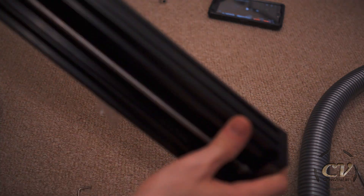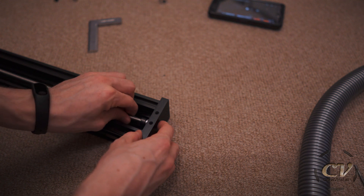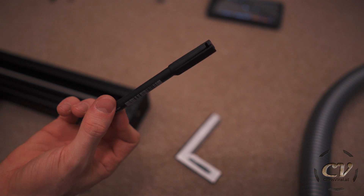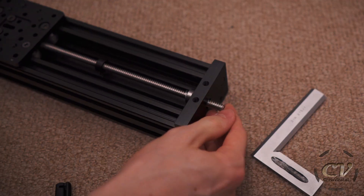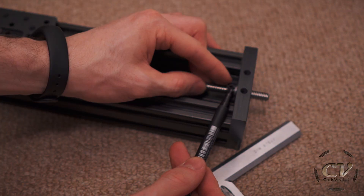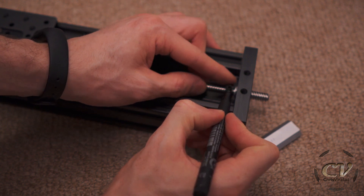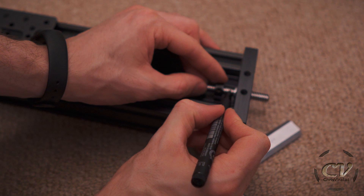It's not that hard. It's a bit tedious — definitely more work than just screwing it on, but should be no problem. I started with this side, took my L-piece to align the lead screw, and I took a Sharpie. Let me demonstrate this on the other side. It's all the way on the other side — bearing goes in, opening up that lock collar. Take a look where this screw is, take a Sharpie, and mark the spot right there.